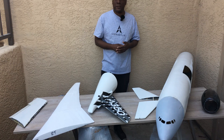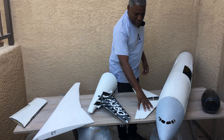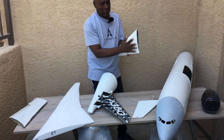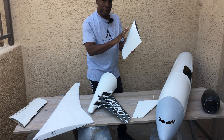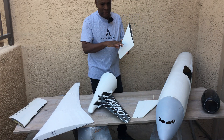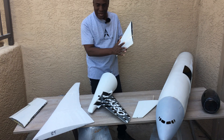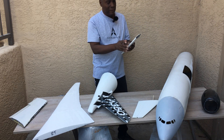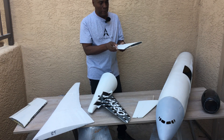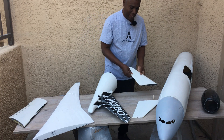If you don't really understand what TABS is, just imagine this being in a mold. I laid up in a negative mold — I put down a layer of fiberglass, wet that fiberglass out, put a layer of foam on that, then put another layer of fiberglass on top, then vacuumed back that whole side — Total Area Vacuum. Then I made the other side the same way. When the two halves were dry, you epoxy them together to give you a very lightweight structure. That's what TABS is.